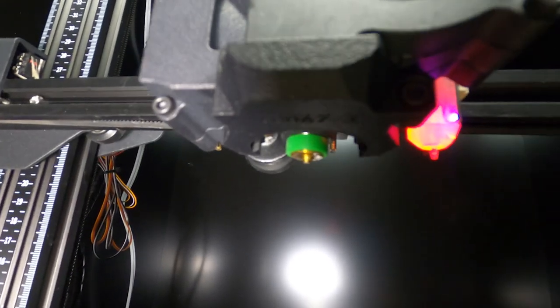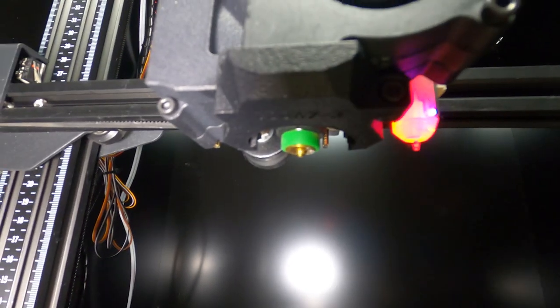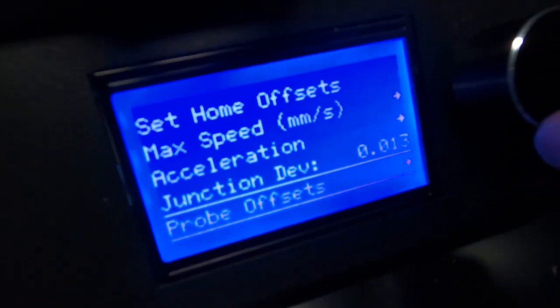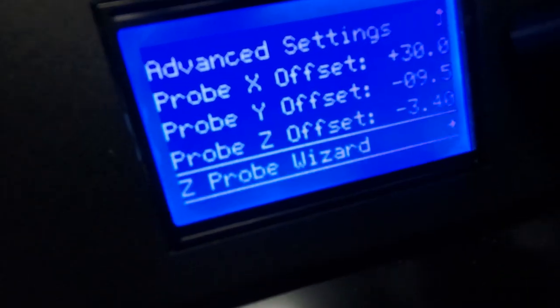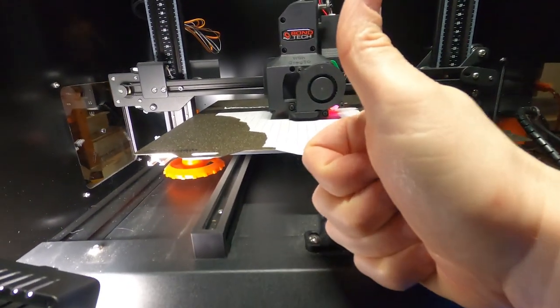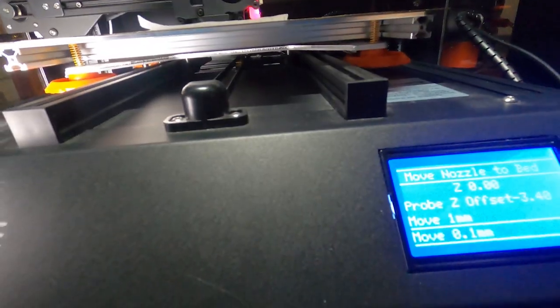The fix for all this is, first of all, eyeball it — make sure you have the proper clearance for both the BL-Touch and your nozzle. The other thing you'll want to do is run, if you have a Marlin-based machine with the current version of Marlin, the Z-offset Wizard, which will lower the nozzle to a certain distance where you manually crank it down and adjust with a piece of paper. Since then, all is well. But I had not thought to check that Z-offset, and what was happening was my nozzle was crashing into the bed because I had encroached on the distance where the BL-Touch wasn't quite able to get down there.